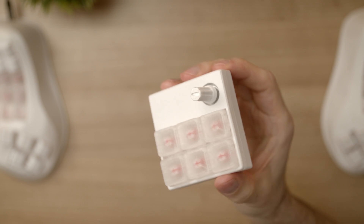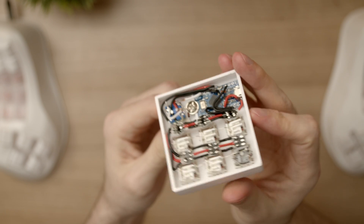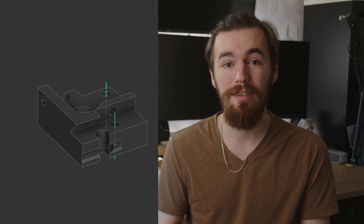If you followed my series on this MacroPad you will notice that I'm still using the same hotswap sockets, but I soldered the wires on the back so that this time they're overall more rigid. I did design a new version of these hotswap sockets that should increase the contact accuracy as well as how simple they are to solder and assemble. But now these do not use the clips anymore, so either you need to solder them or you use the wire twisting method like I did on the 60% build.